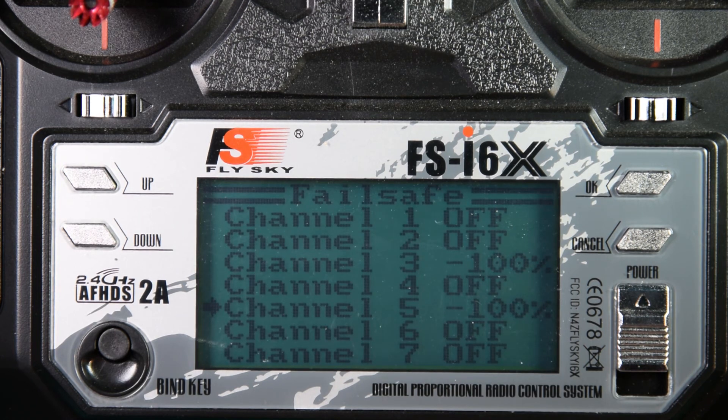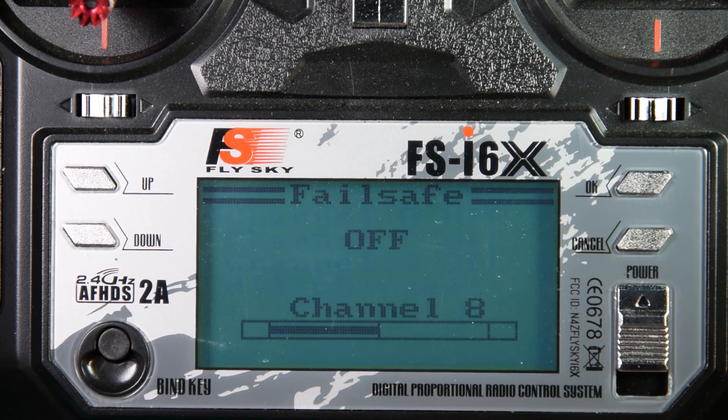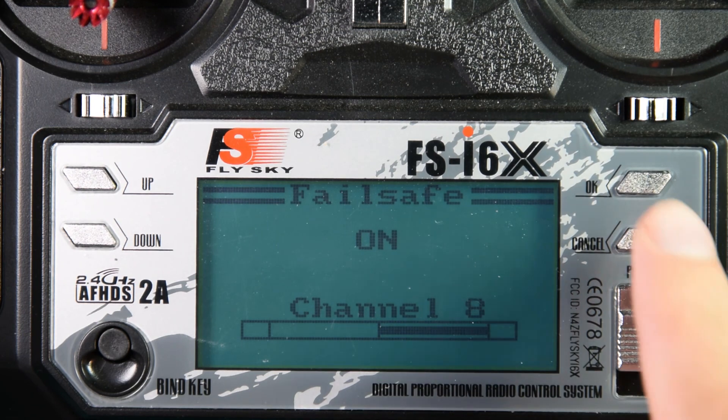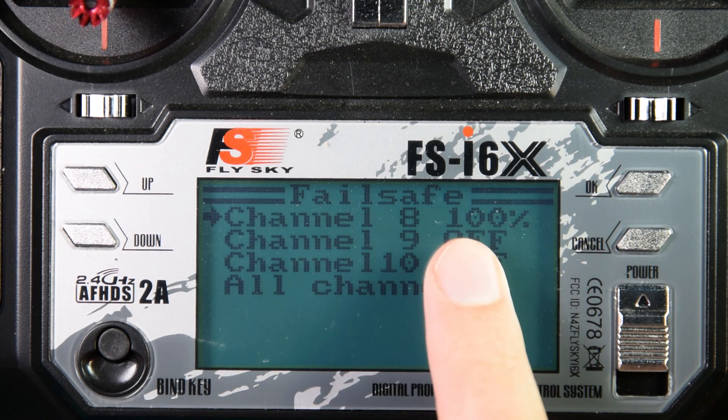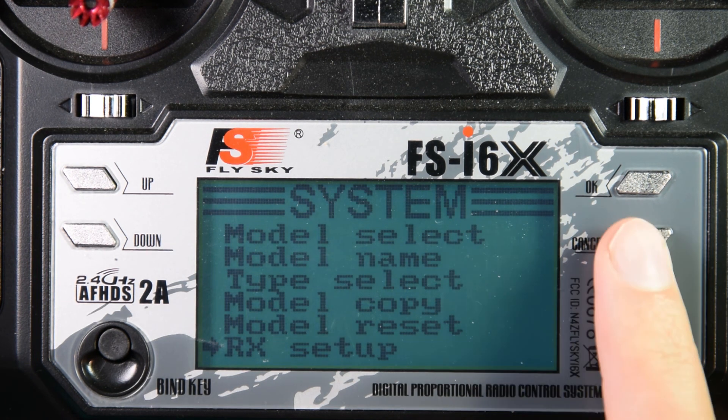The last thing — and this is an optional one. Because I fitted a buzzer which I want to use as a lost plane alarm as well as the voltage alarm, I want to set the quadcopter to trigger the alarm if it loses contact with the receiver. This means if anything happens and I'm not able to turn on the alarm myself, the quadcopter will do it automatically. I wanted to use switch D as my lost plane alarm, mapped to channel 8. I'll go into that, turn it on, flick the switch down — which I want to be alarm active — and hold cancel. Now channel 8 is at 100%. I'll hold cancel again to save those, then cancel out of the menu.